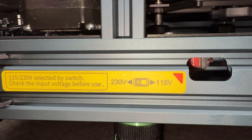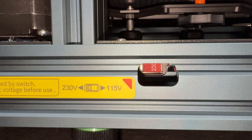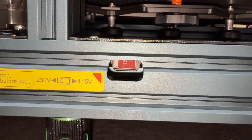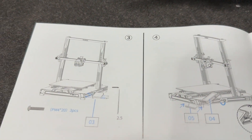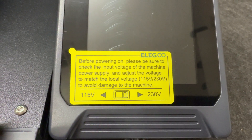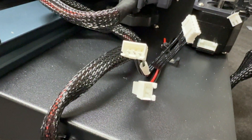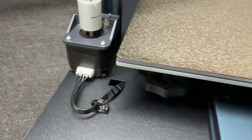I want to show you this little switch right down inside here — it says 230. You're going to want to flip this switch to 115 if you're using normal power outlets. It has to look like this. Up next was a little bracket — just three bolts, super simple. It magnetically holds a panel with a label about that switch, and that panel plugs in right here. You can take it off to do your work and put it back on — I like that feature. Now for the wire connections: each plug is different, so you can't mess it up.